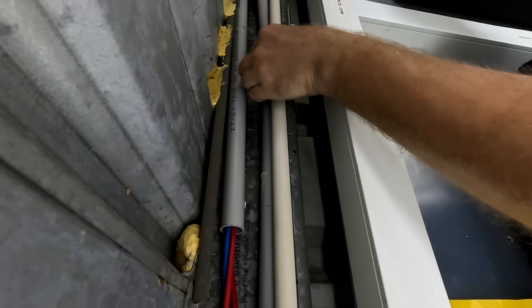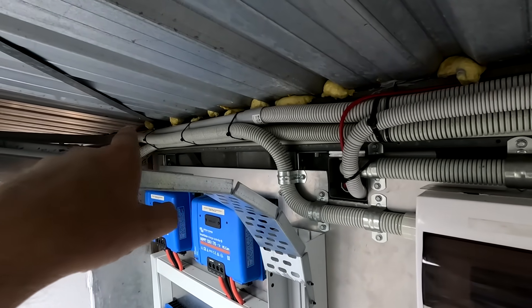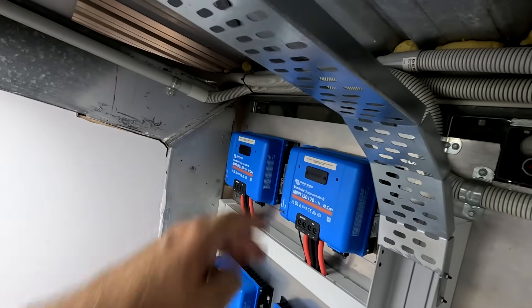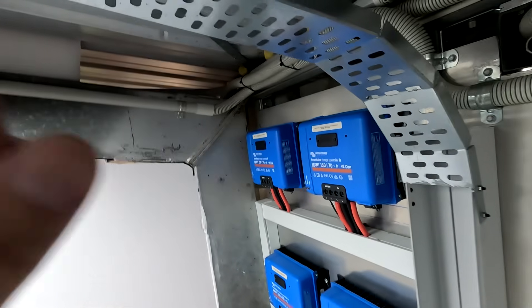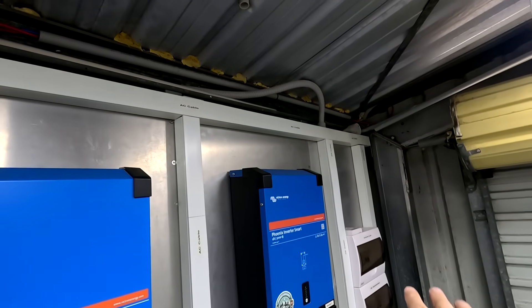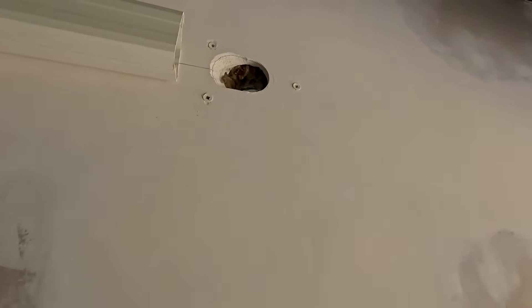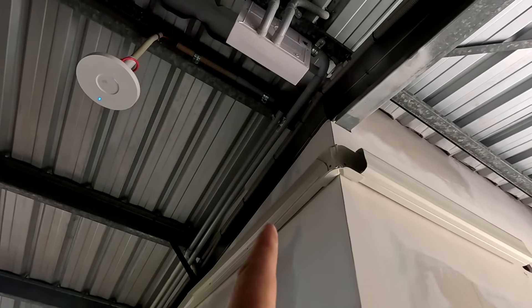Here it is. That was definitely the last conduit in this area down there. This is a total congestion because of this structure going in at 45 degrees into the corner — it divides the whole space in two parts and this material is so thick it takes almost all the space. It doesn't matter — I've got it. I'll leave the rest for the electrician to connect everything, go down with the circuit breaker, and connect the aircon. I've set the wall anchors for the outlet: air-conditioned duct, outside corner, air-conditioned duct, another piece of duct. It actually doesn't look too bad — the one up there looks almost straight, which it isn't, but almost. Better than having it on an angle cutting the corner of the door.